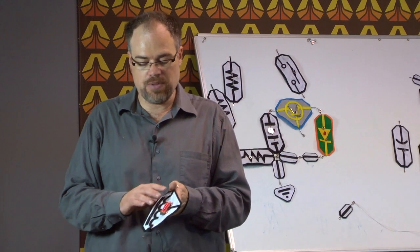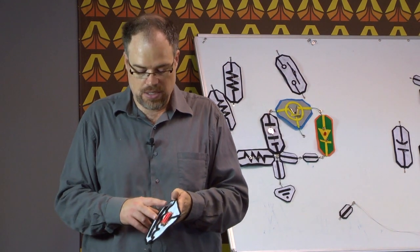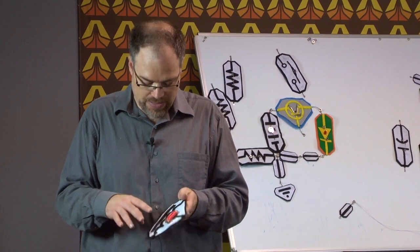So this contains in itself the basics of what we're dealing with in terms of electromagnetics, which is a coil that creates the magnetic field, and then immediately, we're not moving any motors or gears or anything, but immediately that magnetic field is detected on the back end, and it shoots out the bottom in the inverse in a phase delayed form, right? There's really two coils on it? There is. There's a top coil and a bottom coil. They happen to be connected in the middle. They're the same wire in a sense, right?